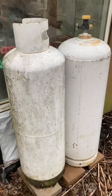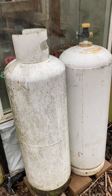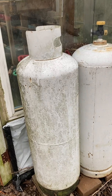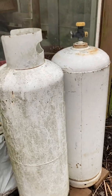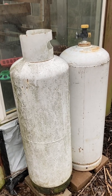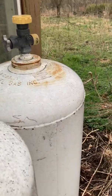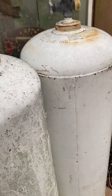What we're looking at right here — these are 100-pound propane cylinders. They hold 23.6 gallons of propane when they are filled to 80% capacity. All propane tanks are filled to 80% of their water capacity because the propane needs room inside the tank to fluctuate around.